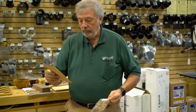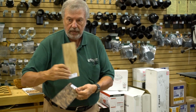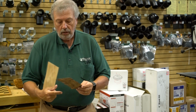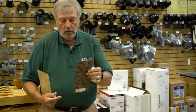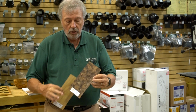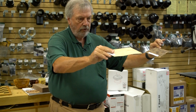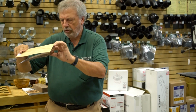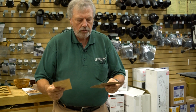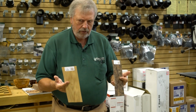This is a white oak flake cut, and this is designed to show us the nice pores, the nice grain. Okay, this is a walnut burl. A burl has got the grain running every which way but loose. These are not flat. By cutting them this thin, they'll warp. If you're going to use them as veneers, you've got to flatten these.